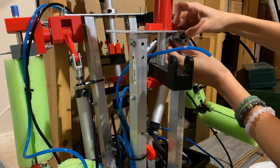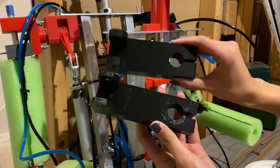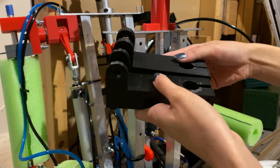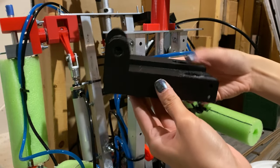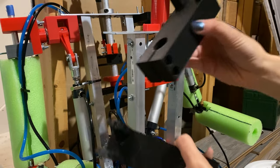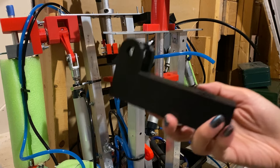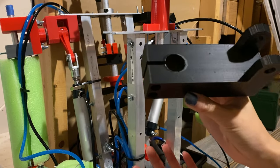Here's the one that was just on here, here's the new one. What I did is it's wider - I honestly don't know what the whole plan was. I think I obviously made it bigger so there's more structural integrity. I made the clevis part of this wider. The infill on this is like 50% as well, so I think it was just a structural thing. While we're here, let's just install the new one, because I also designed this to be able to tighten better.